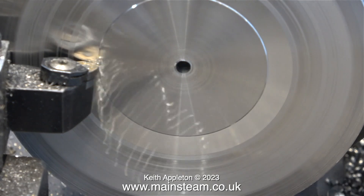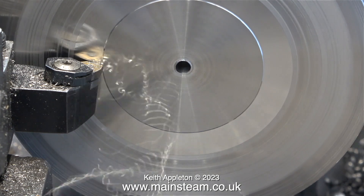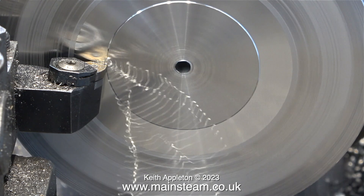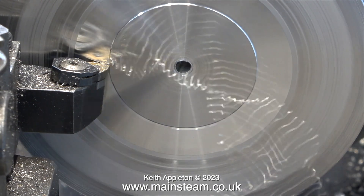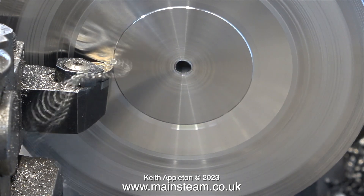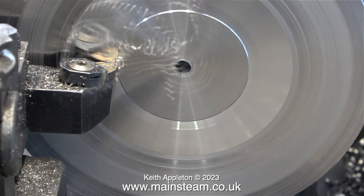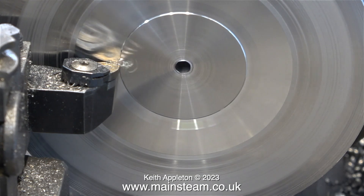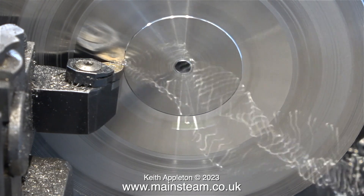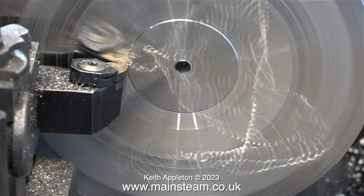If you've been paying attention, you will notice that I've just changed the tip — so now this is a new tip, it's cutting beautifully, and look at the finish on the piece of work. In this clip I'm taking a very light cut, so I've speeded up the lathe — it's not in back gear anymore. You still have to be careful though: if you're not using coolant, which gives you not only the cooling effect but constant lubrication, you will probably get chatter if you go too fast. This is okay, particularly considering that the speed of the cutting tool on the power cross-feed is also quite fast.